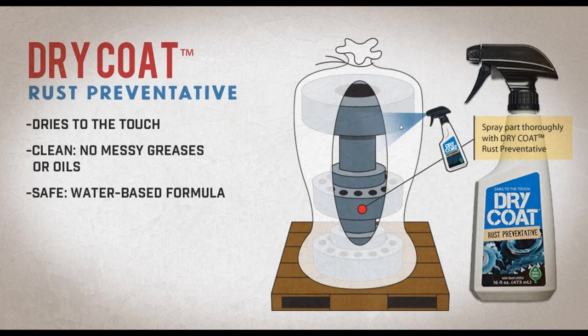The last product I want to share is Dry Coat Rust Preventative Spray. Dry Coat is a great way to protect sensitive metals and components inside large packaging. It is a water-based rust preventative spray — yes, water-based. You spray Dry Coat onto your metal parts, it dries to the touch within 30 minutes, and it does not leave any greasy, sticky, or oily residue. You do not have to use a harsh rust preventative oil. Before you package your metal in C-Film, you can spray it with Dry Coat to give it that extra rust prevention barrier.